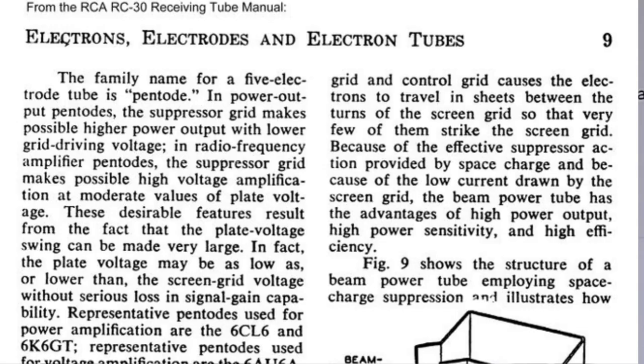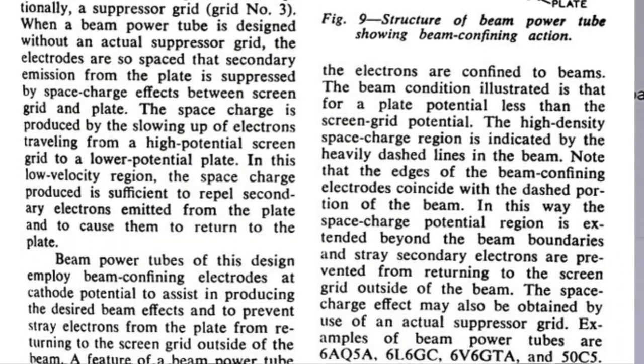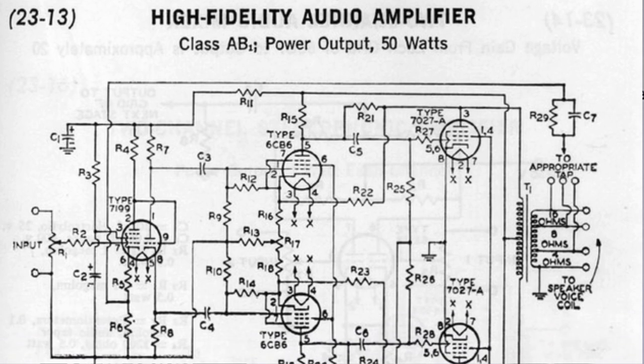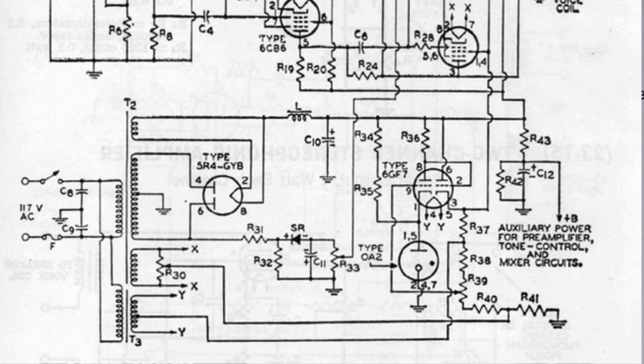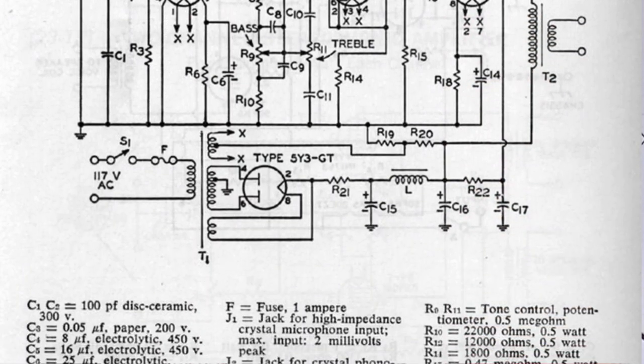You need to pick up this manual. Also, in the first couple of chapters you are going to find a lot of useful information — general information about how to apply Ohm's Law, common circuits used in audio output sections, common preamps. You're going to see a lot of things in there that are going to be extremely useful if you are still learning about tube amp circuits. So pick up an RCA Receiving Tube Manual.